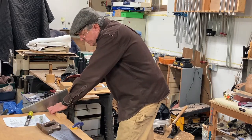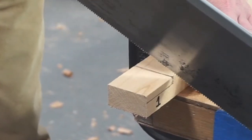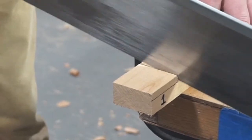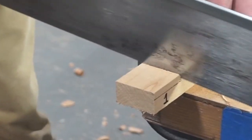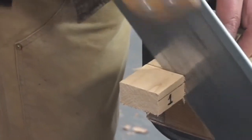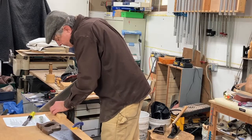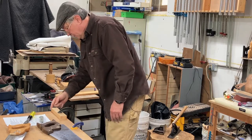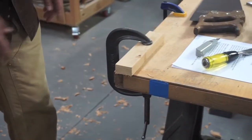As in the second class saw cut, I bring my saw up to the work. I let the little wedge that I cut on the end do its job. I bring the back of the saw down to follow the line, although in this case I've already got a nice wedge drawn all the way across the board. And now I have a cut that is both accurate and leaves a very nice edge right at the show face where you need it.